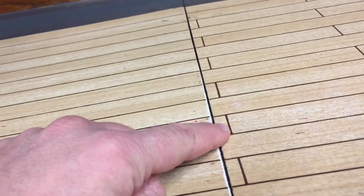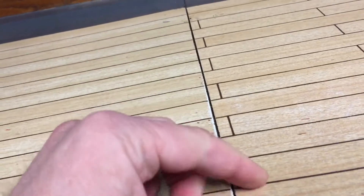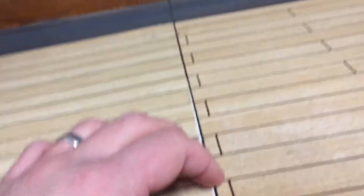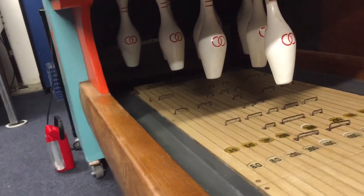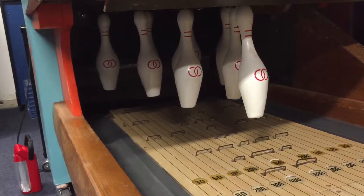The trick is to make one side a little bit higher than the other so it won't hit the edge and chip — I could do that by adjusting those screws, or by using little wedges of wood. It does have gutters on each side, obviously. There are gutter switches in there — you can see a little hook switch on the left, and there's one on the other side — which tells the game if you made a gutter ball.